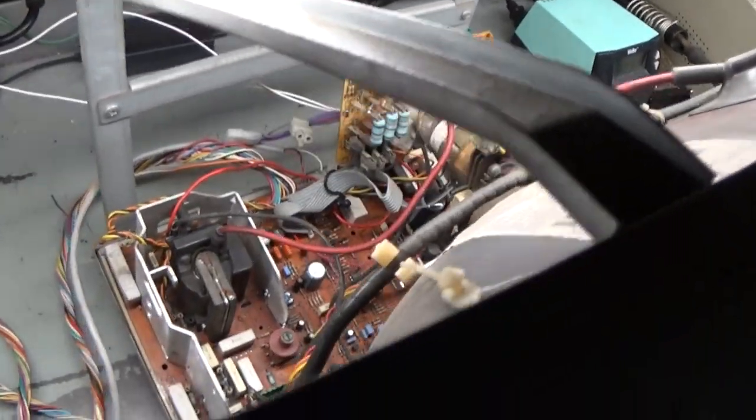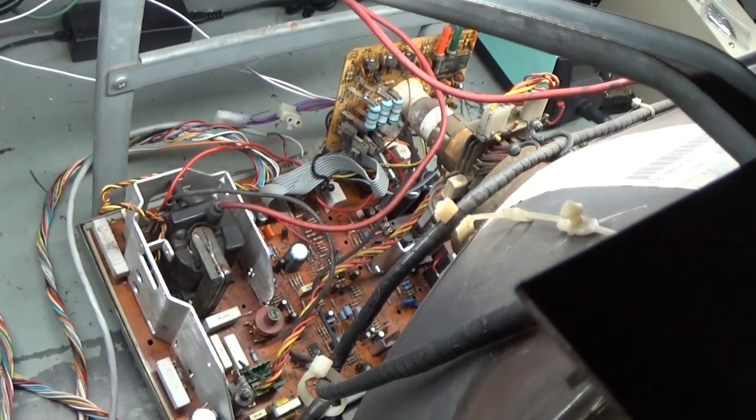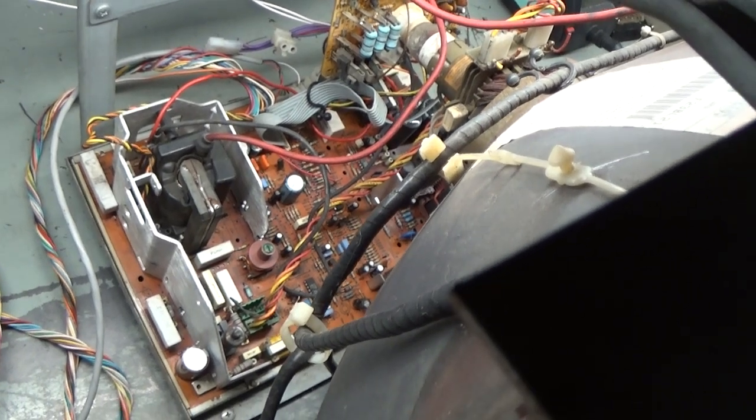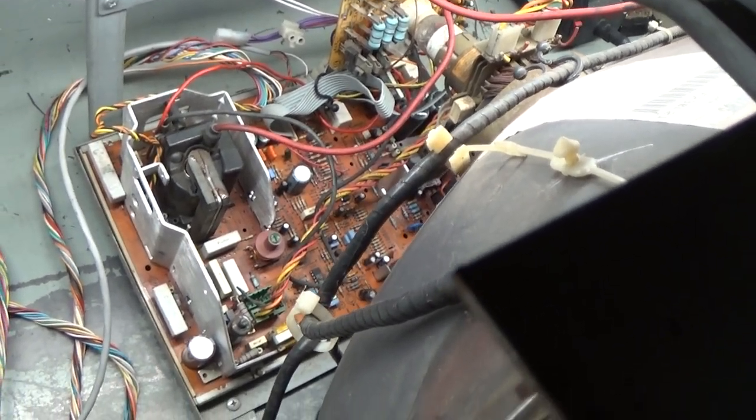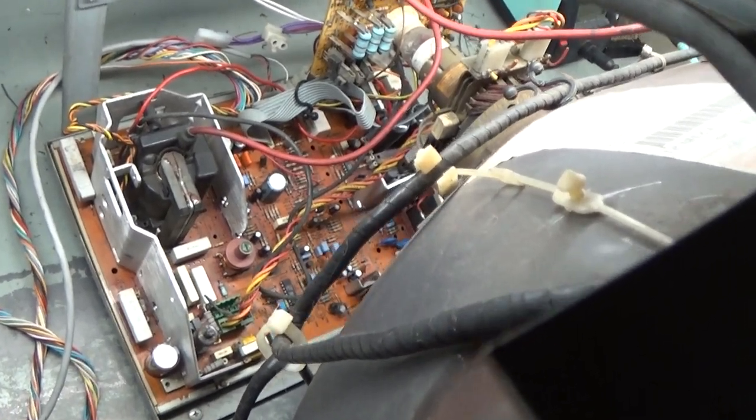Wow, okay. Well, I guess now that we know what was wrong with it, it started out collapsed and got uncollapsed slightly, and then the cap exploded. So, I guess what we'll do is we'll do full reflow, full cap kit, normal work, everything that needs inspected, done, and tested, and then we'll try again. Hopefully the new cap doesn't explode and I don't find anything else.